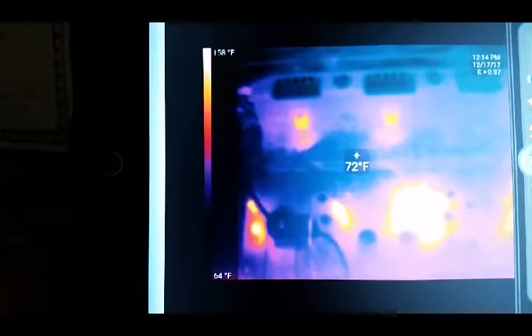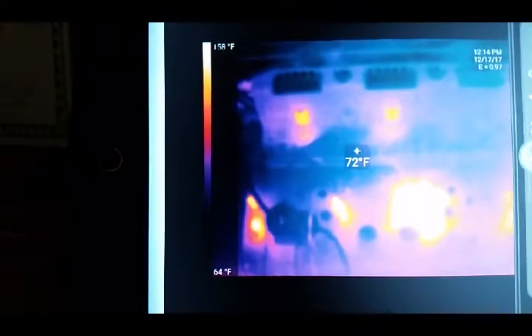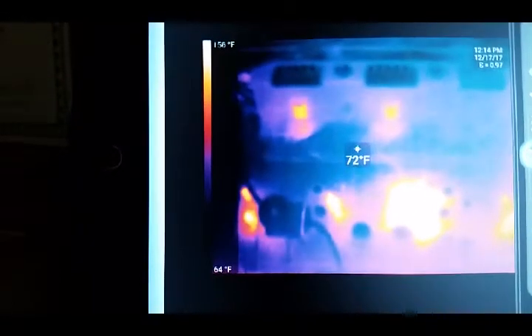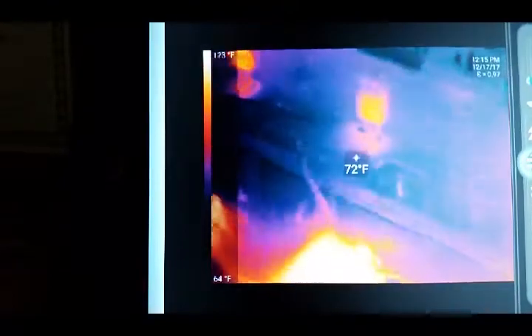So at this point we're looking at the transistors here in our STA-77 Realistic. You can see that this is the left channel and the transistors are operating correctly — they are producing heat, therefore they're working correctly. They're running at about 82 degrees on that one, and about 82 on that one as well.